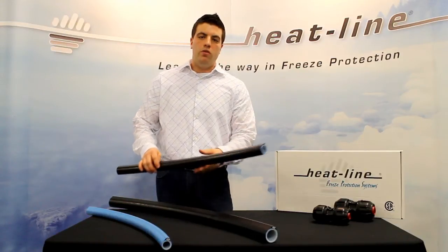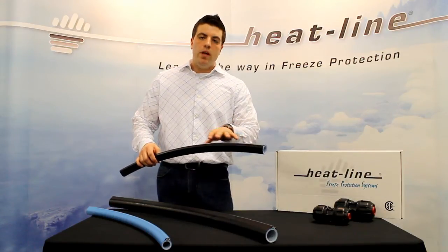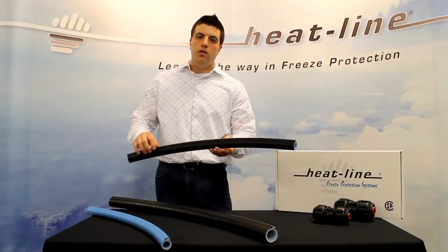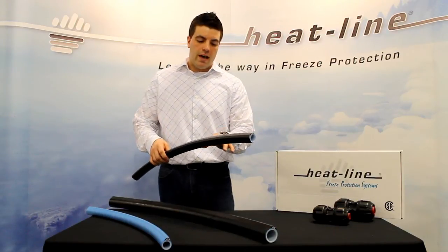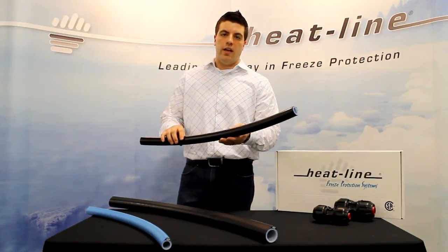The Carapace system is always recommended to be used fully insulated with a thermostatically controlled device. Even though we incorporate self-regulating technology, the heating cable is always a consumer of energy. So it's important to use a thermostatically controlled device which has a sensor that is placed on the outside of the pipe to turn the product on and off, thus duty cycling.